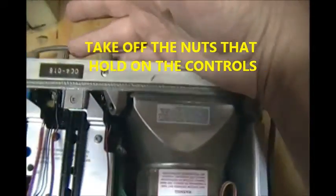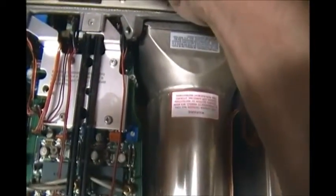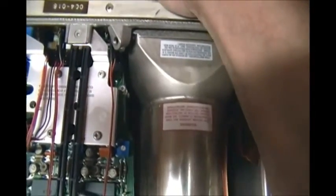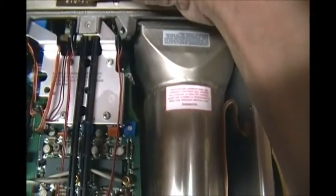In order to remove this board, I've got to take this out — I've got to pull knobs off the front. All this has to come out; these have to come off. This control here, which has the knob I glued on, is the up-and-down positioning control. All these knobs and controls literally have to be taken out and pulled out. I'm not going to do that; I'm not pulling this board.